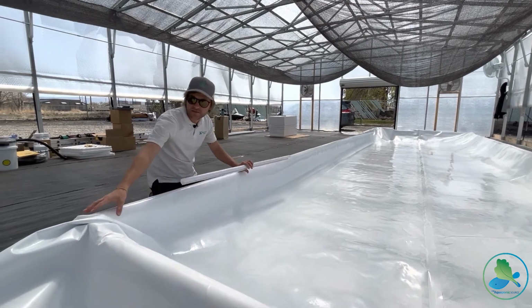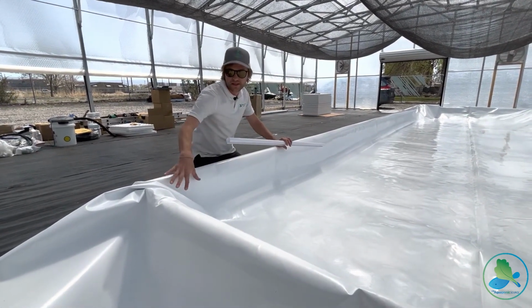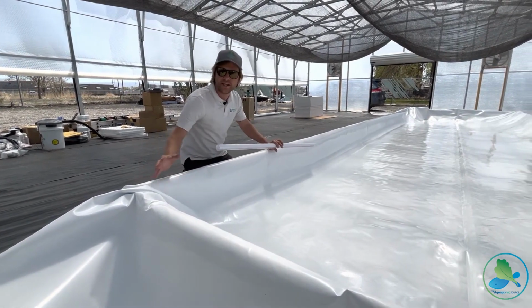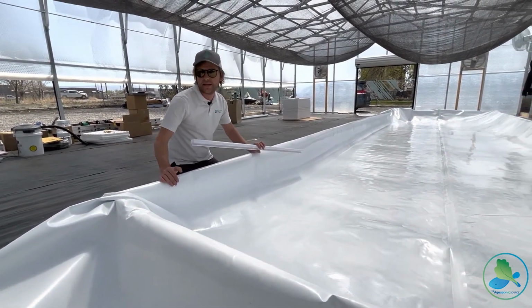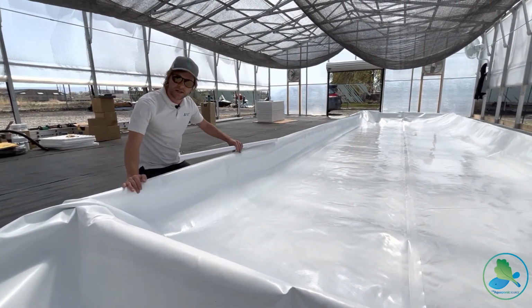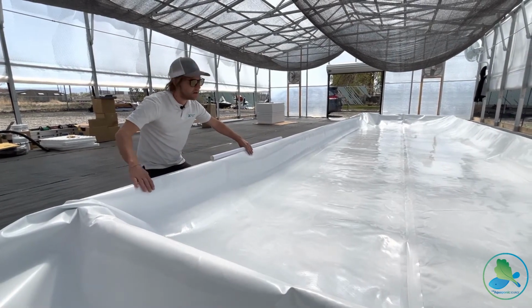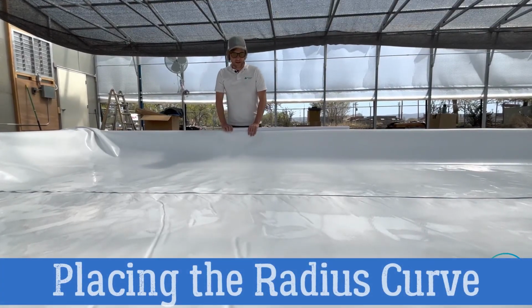And now the reason that we'd use this phantom clip and go 4 feet down rather than starting on the corner is because of these corners, we still need to fold these over, and we will be borrowing a lot of this excess Dura Skrim and pulling it and kind of manipulating it to how we need to make an even fold on the end. So when doing your rail clips, start 4 feet from where you would normally start and leave this down.